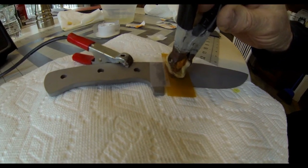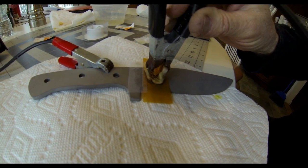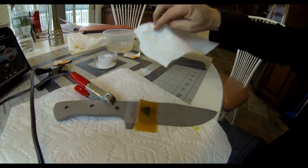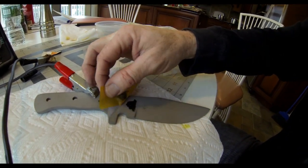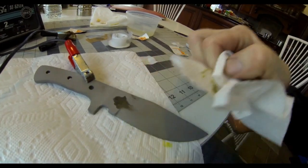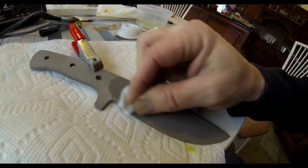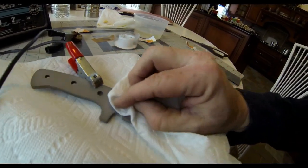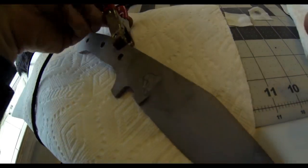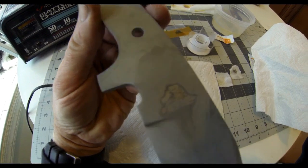Before I do that, let's go back one knife. This is a drop point knife — the first knife I attempted to do a glass bead finish on. I had the bright idea of, after glass beading it, adding my maker's mark, which is electro etched into the blade. I realized as soon as I did it that I usually polish my maker's mark after I etch it, using like a 1500 grit paper to make it look good. I can't do that on a glass bead finish because I would sand away that dull matte finish. So I almost ruined this knife. I was able to save it, but I had to sand away all of the glass bead finish, polish the blade, and recreate the maker's mark in the correct spot.